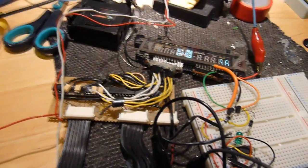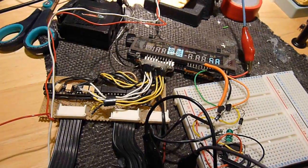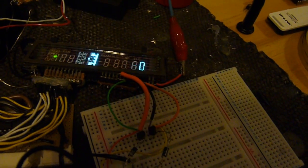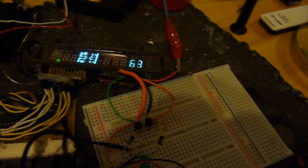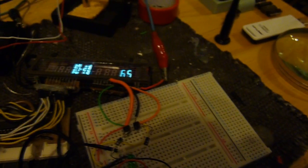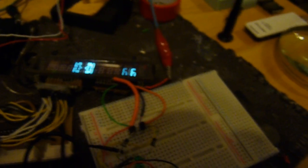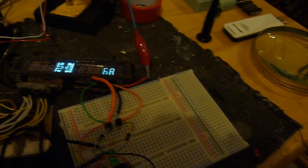So how does this thing work? Because Tribalmasters actually asked what is a multiplexer. It's far too complex to explain by words without doing a full essay. But pretty much it's a process of getting a signal from one part which you want to get down one line, but there are several signals you want to get down that line to represent the data. So in this case we want individual numbers — digit one here, digit two here — and not to end up ghosting among each other so they become undefinable.